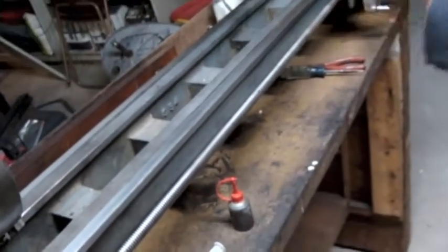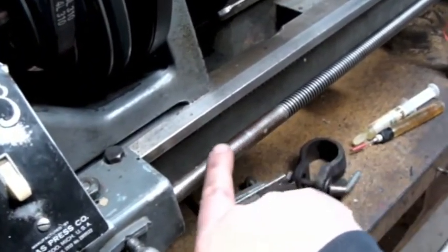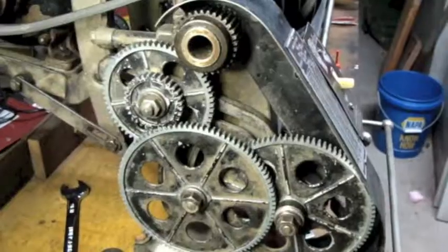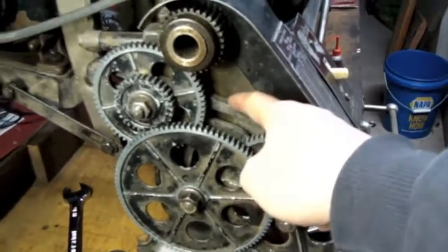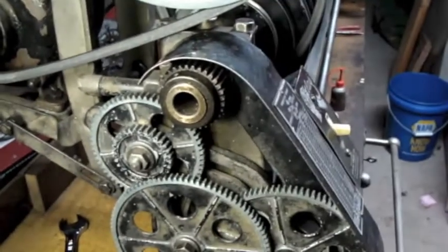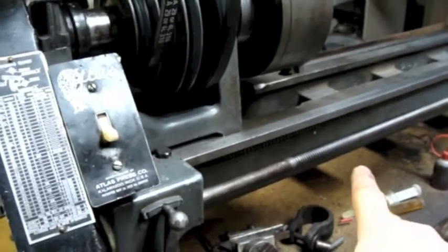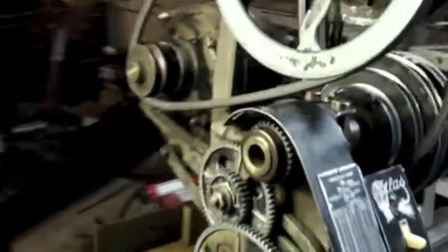I've got the carriage all the way down there with the half-nut engaged on it. With the bracket broken, what would happen is this lead screw would probably just unscrew itself out that way and then the gears would fall out here and stop it. So just so I don't forget and accidentally do that, I'm going to adjust this bracket back down. That will disengage this gear from the spindle — this gear on the spindle is the main drive that starts everything. I can keep this lever in the center position; that should keep it in neutral and keep the lead screw from turning. So theoretically I should be able to fire this up.